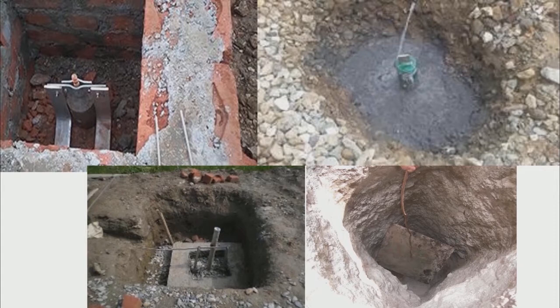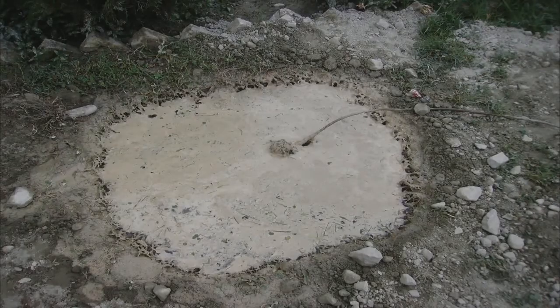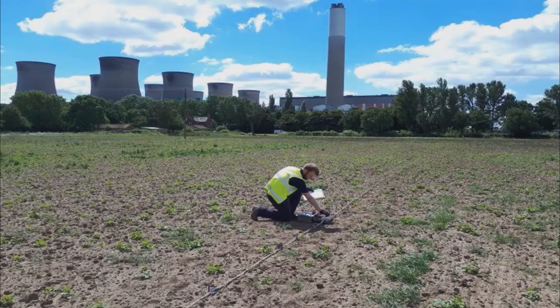But this isn't the most right way to do it, because during the rains the hole dug in the ground will be filled with water or get too mucky, and within a period of time the earthing disappears and is washed away by the excess water. If a construction is taking place around the earthing, they might completely demolish it and level the ground as per their convenience. These are the problems that one has to face.